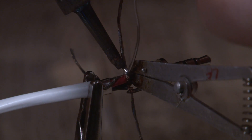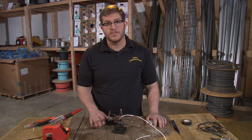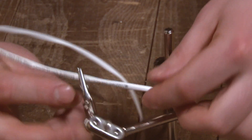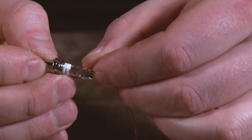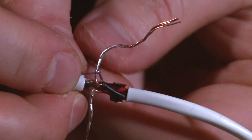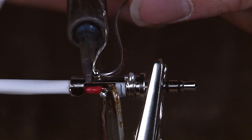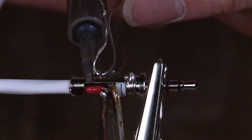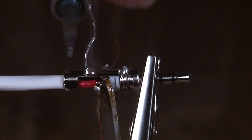A proper solder will be just as shiny after it cools as it was on the spool. To do this, you need to keep everything perfectly still — this is why I'm using the helping hands. Now clamp the wire down to reduce cable strain. Don't over compress and regularly clean the solder tip on the sponge. Insert the wire all the way to the metal; you want as little metal as possible showing. This limits shorts. Always use the soldering iron to heat the joint, not the solder. A small amount of solder will help the joint conduct heat much more efficiently, causing the solder to be heated by the joint, wherein it will soak into the connection, resulting in a much stronger joint.